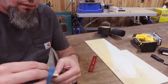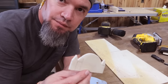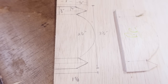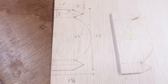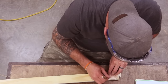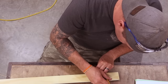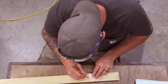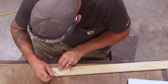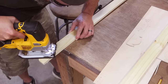Here's another tip: always keep some quarter inch scrap around just to make your jigs and templates. This little castle-looking thing actually makes awesome looking gingerbread trim. Here's one with all of the measurements laid out — just screenshot this and duplicate it. With your template made, find where you want your gingerbread to start — I wanted a rounded edge to start with. Then keep moving this template over and repeating the process of tracing it out until you get to the end. The board I'm tracing this out on is part R. From one side it looks like little mountains, but it will have a different profile from the other side.